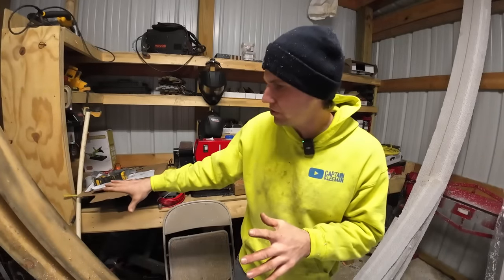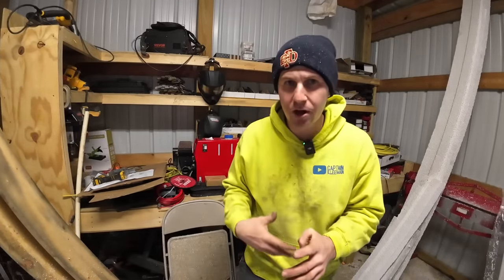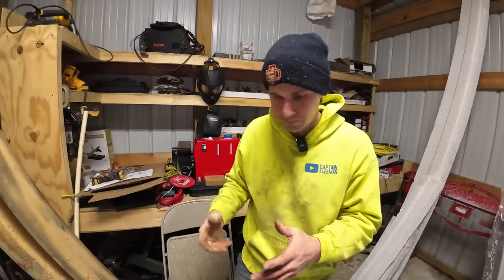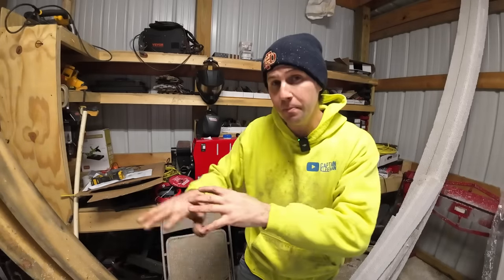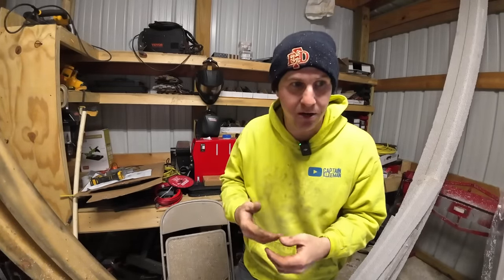I'm gonna let that thing charge up a little bit, get it back over 50%. It shouldn't take too crazy long, an hour or two, with 1700 watts pumping into it. And then we'll put a voltmeter on the extension cord, unplugged from the unit, and we'll see what happens to that voltage when that outlet kicks on and off.